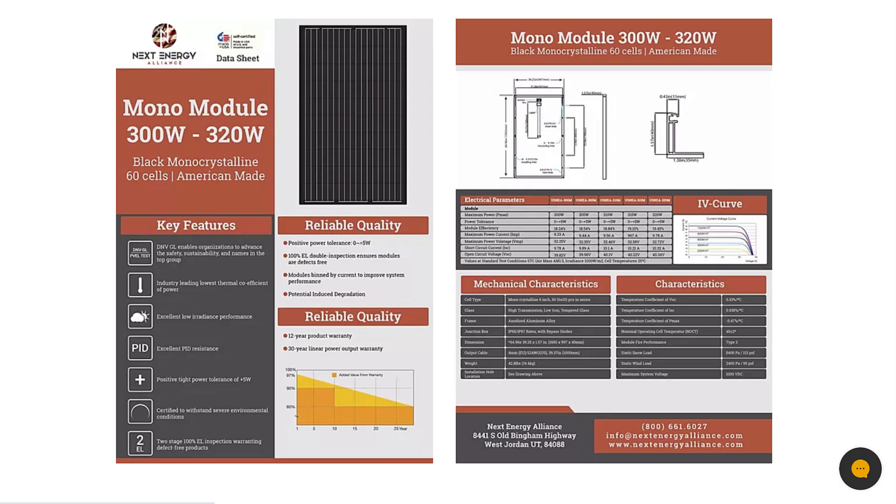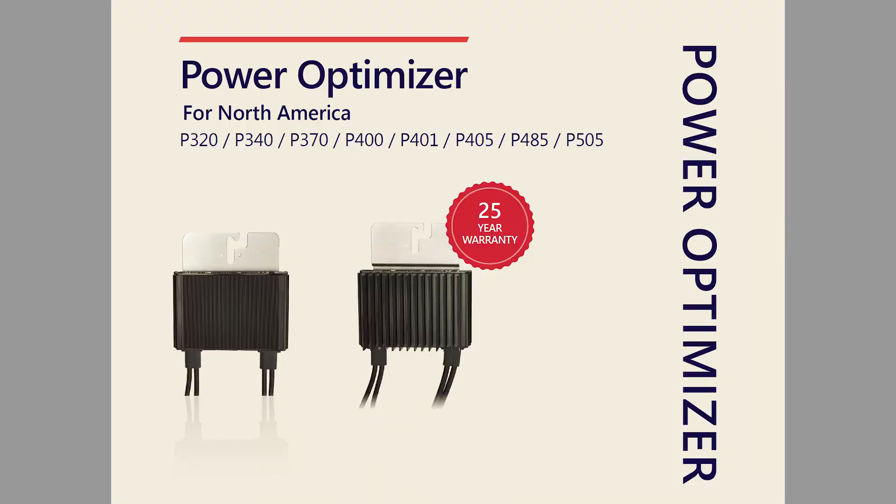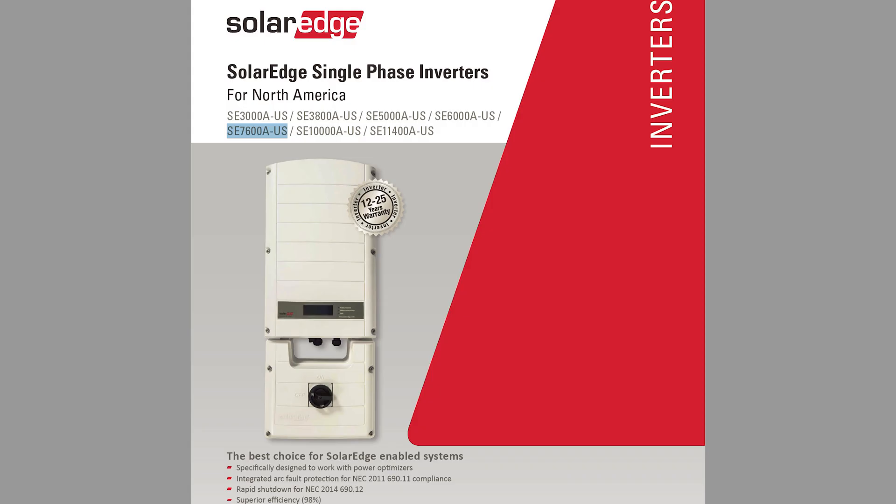The racking would cost a little bit more upfront, but minuscule compared to the long-term energy production of the increased size and capacity. The design I settled on was 12 NEA 300-watt panels with power optimizers from SolarEdge that pair with my existing SolarEdge string inverter. That brings my total solar array to a 9.98 kilowatt system. Now this is quite large — it's double the size of our energy consumption needs prior to having any electric cars and the freeze dryer. But now having two electric cars and a freeze dryer, it made a lot of sense to go big.